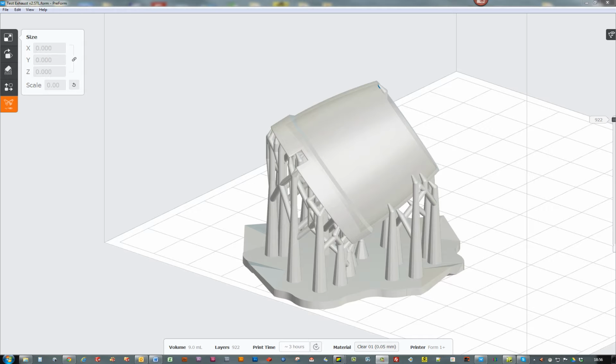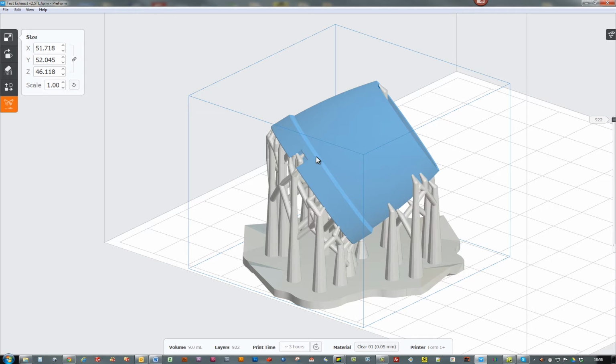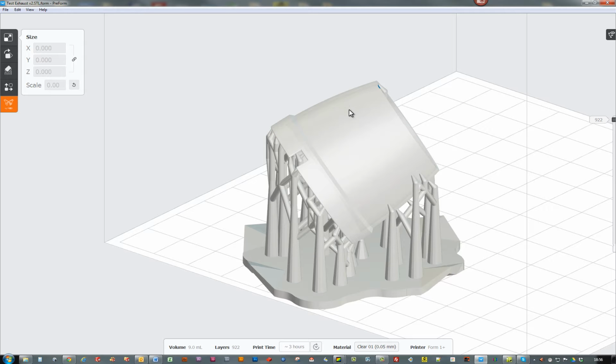The second point you raise is about the air bubbles working their way into the part, and yes, I did actually read that article when it was first published. I did have parts at the time that I was having problems with, and I attributed those problems to bubbles getting caught up in it. Actually, on this part there is an area where that happens that I'd missed, but it's not where the defects are actually on the part.